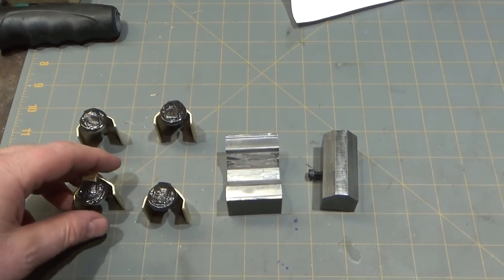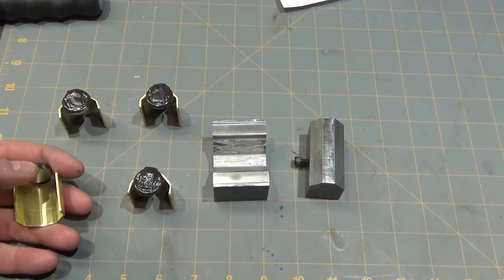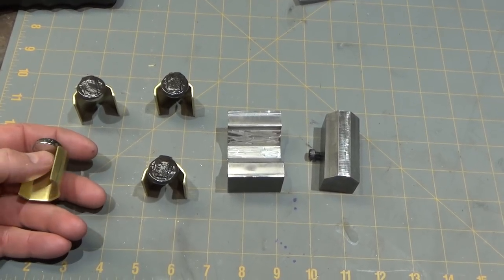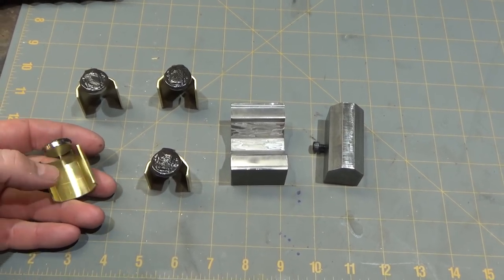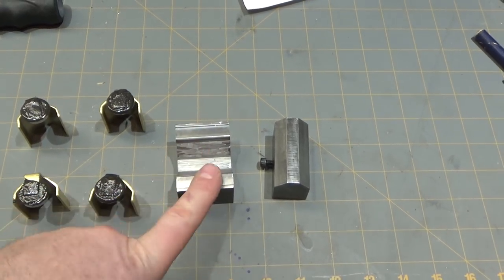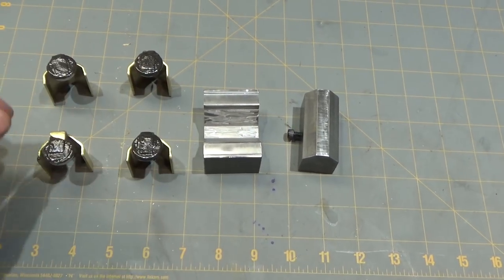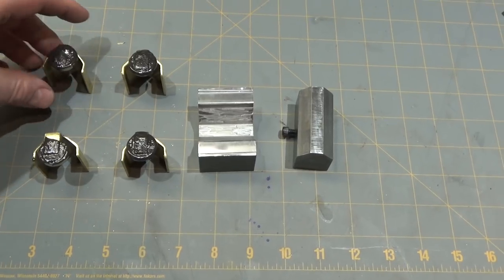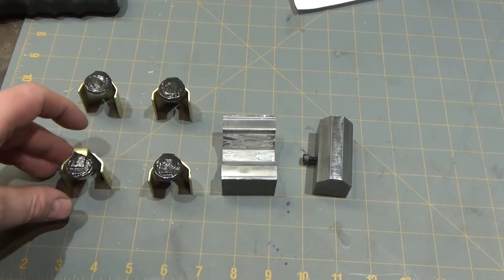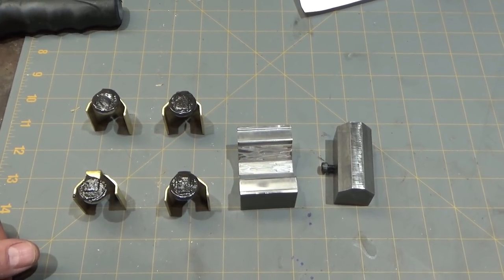All right, so here are the finished products. I'm sort of on mixed ground with the magnet idea, because it will hold it in place, but I do have concerns that it's also going to attract a lot of metal particles when I'm doing steel. Also, I designed these dies for 50 thousandths material, which this one piece is, and I grabbed another piece out of my bin, the other three are made out of that, 62 and a half thousandths, and that wedged in there because there wasn't enough clearance for the extra.